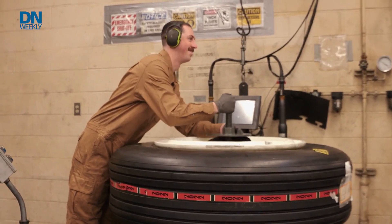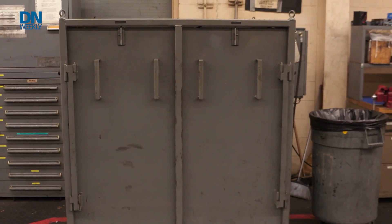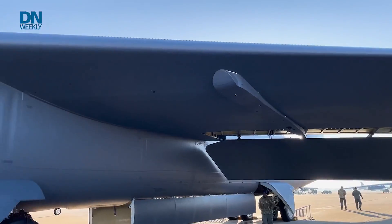When that's all done, we're up to our air machine. This airs the tires up to 315 PSI. When it's aired up, we roll it out and put it on a leak check for 24 hours. If it passes, we'll put the bearings in — which go inside there — and then send it out to the flight line.